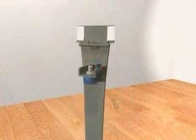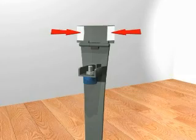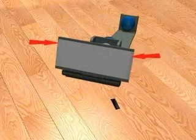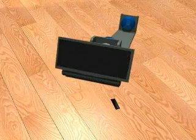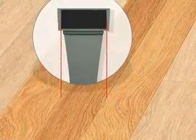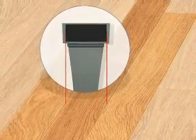Step 1. Simply apply the double-sided tape provided in the kit, attaching it around the hinge. Then, slice the tape to fit the width of the board. Remove the protective layer from the tape. If using the Unifix on narrow planks, such as Elegance, cut the protective layer so that the adhesive layer only makes contact with the plank that you wish to move.